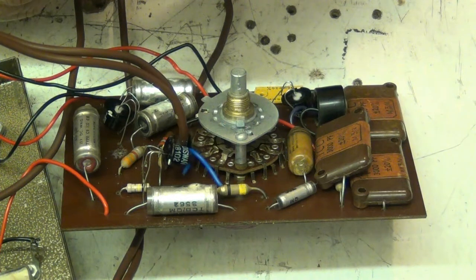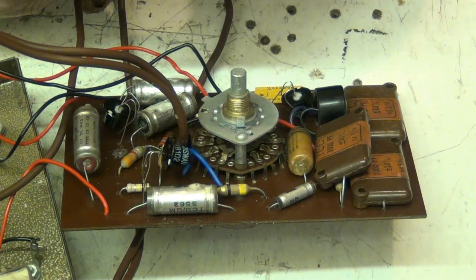And we've got one more resistor left, which is R8. I didn't see R7. Might be one replaced. We've got R3, which is 47 ohms. That reads 50. So we can, I think if I remember rightly. That 100k there has been replaced. Right. R8